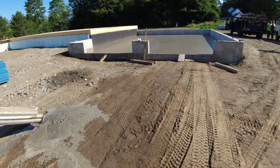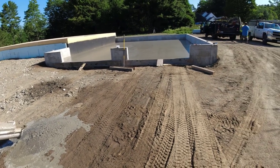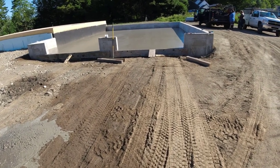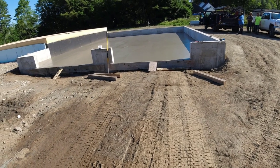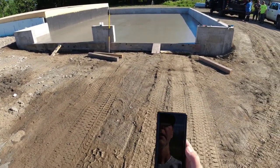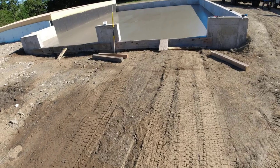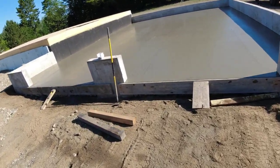Oh yeah, 32 by 44 garage, 2-bay, flat floor, all 3,500 pound mix with fiber. Everything went in really good. This thing's gonna dry really good today. It's gonna cure up really fast. It's 8 o'clock now, started at 7. Probably out of here by noon today, power troweling and sawing, so gonna be a good day. It's a Friday. Thanks for watching, we'll see you on the next one.